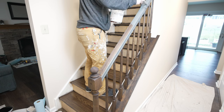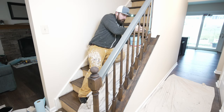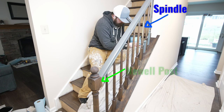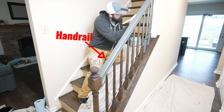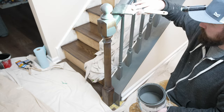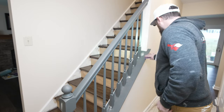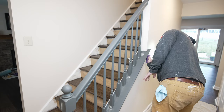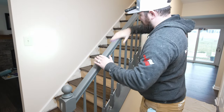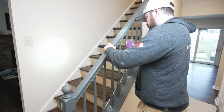When you're applying this product, you want to go with the grain. If you can pick smaller sections to do so you can complete them all at once — like spindles, or a newel post, or a complete rail — then just kind of go with the grain where it makes sense. Give it about an hour or so to dry. Before you move on to applying the top coats of the finish paint, you want to go ahead and sand the surfaces that you primed. A lot of times when you apply a primer, particularly to raw wood, it's going to raise that grain a little bit. Just take 220 grit sandpaper and sand that down so it's fairly smooth to the touch.